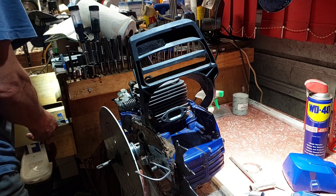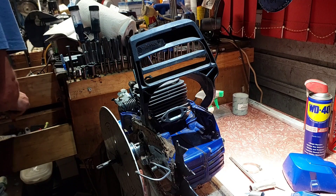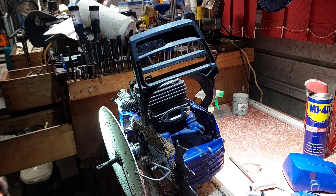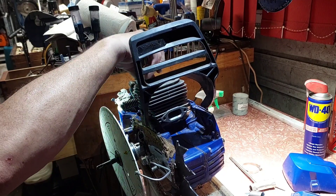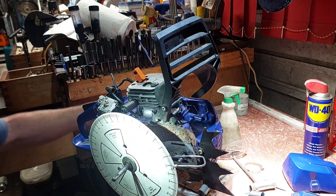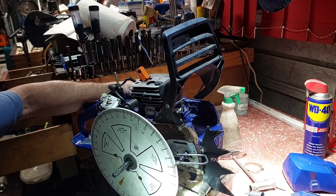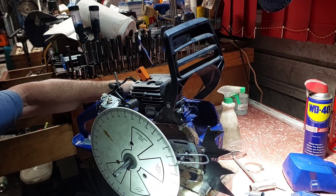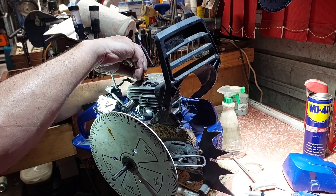I'm curious what this thing is now. Here's my piston stopper — these two bolts screwed down. It shouldn't move but make sure she's in. Winding down to get an accurate measurement on the piston stopper. They should be around 40 I think. Reading at 47. At 47 — so she's still in there, make sure it's nipped up tight.